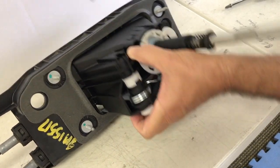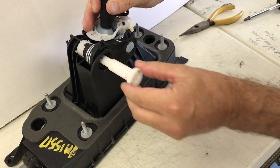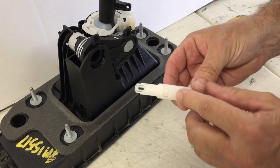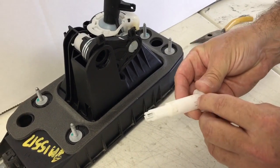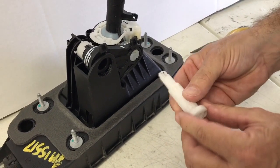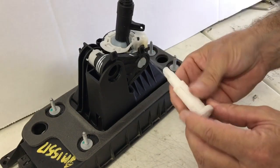The catch is done, so you just pull the pin out. You can see the pin body is undersized and it's got these little springs — eight little springs — that kind of keep the pin centered. That's all you're banking on to keep slop out of this pivot, and it doesn't work.